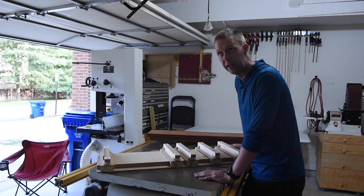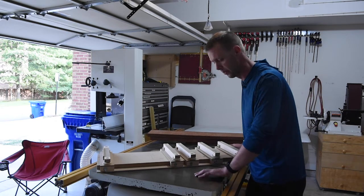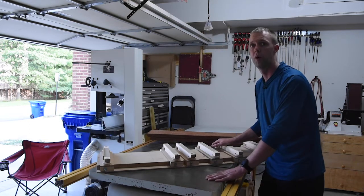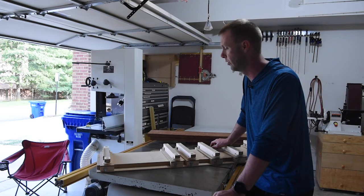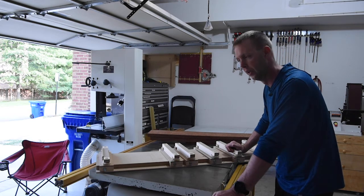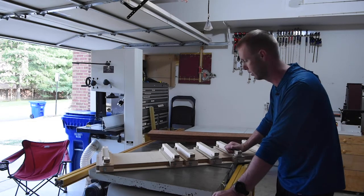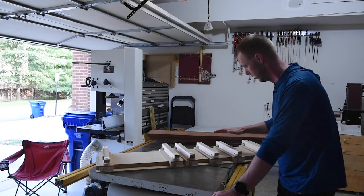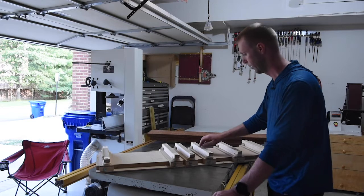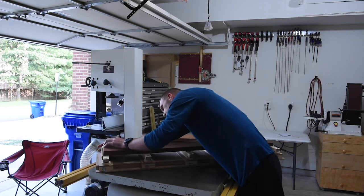All right, so I have a Hammer A3-31 that's supposed to be delivered sometime in December. It is currently September, so I got a while. I have a DeWalt 13 inch planer that I'm going to use, and I built this jig here. If I can figure out who I copied, it may have been out of a Woodcraft magazine, I'm not sure, and then somebody online that I followed their directions. So I'm going to use this as a jointer function to keep the lumber straight as it goes through the planer, to get rid of that wobble